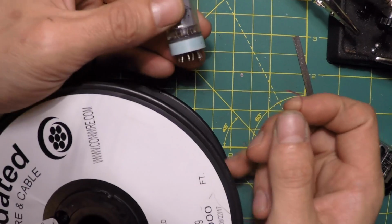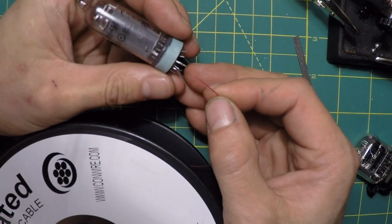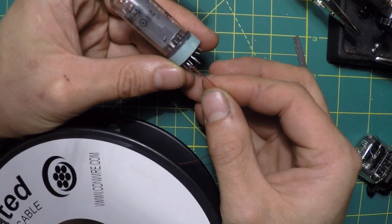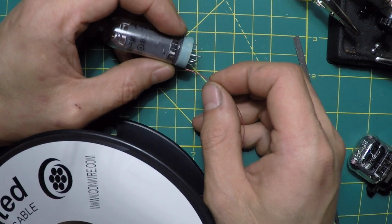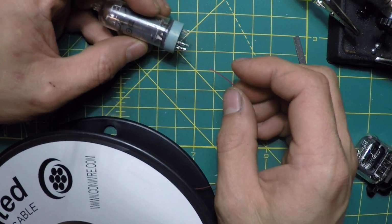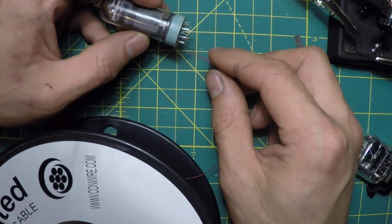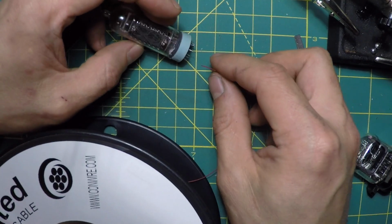So basically what is going to happen is I'm going to wire up the positive one, and then for all the others they're just going to go to a green or black wire. So there won't be any ordering involved when it's hooked up to the circuit, but that's okay because we can simply change the code to make it display the correct digits.